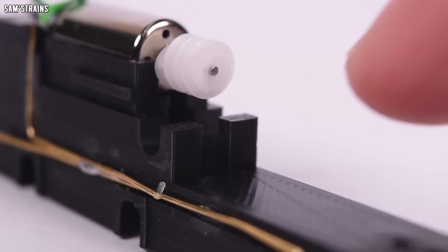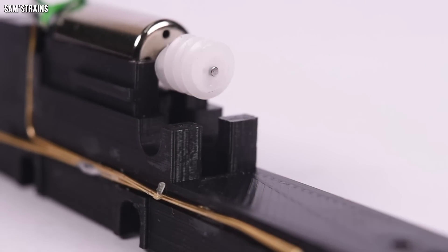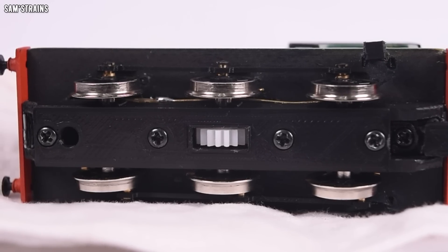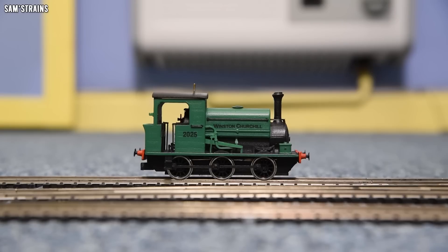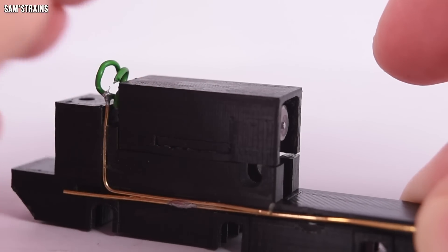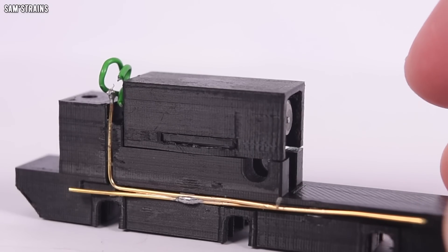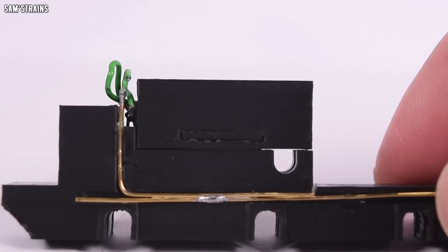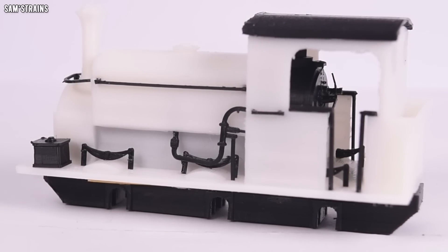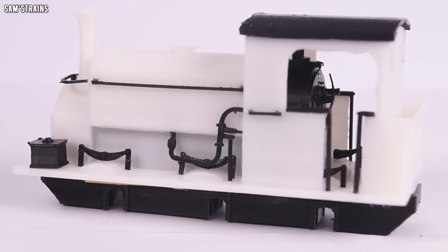The mechanism is very minimal due to its size. The thing runs on just two gears — one gear fits underneath the worm drive and then another gear fitted to the center driving axle. The gearing isn't great, to be honest — the loco is a bit faster than I'd like — but because it's a good coreless motor it is still able to do a fairly good crawl, which is pretty good. There's a motor cover that snaps right over the coreless motor, which also serves to keep the intermediate gear in place — a pretty neat design. The body fits right on top and the whole mechanism is in the tank area, nice and compact.